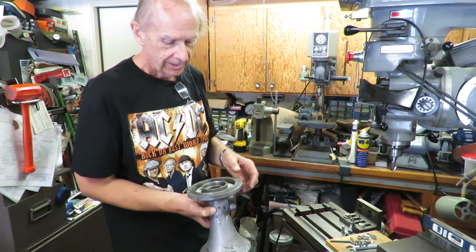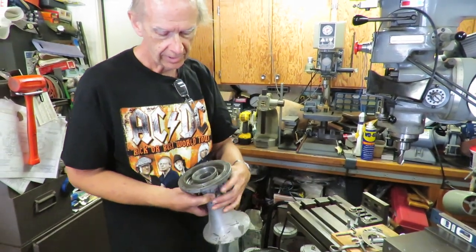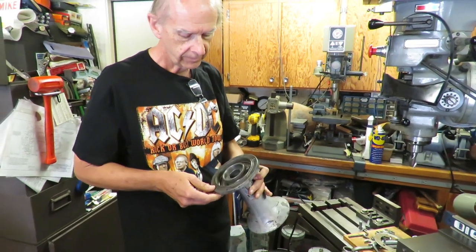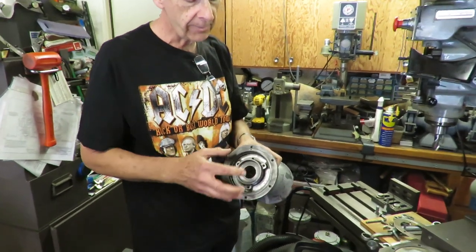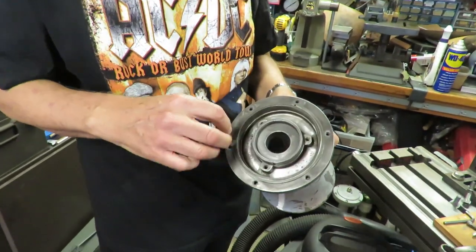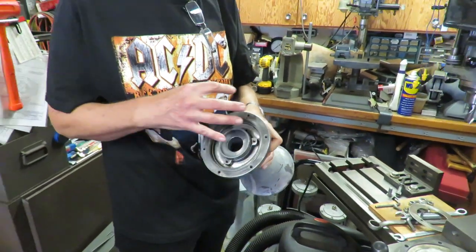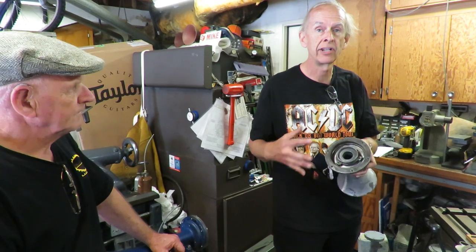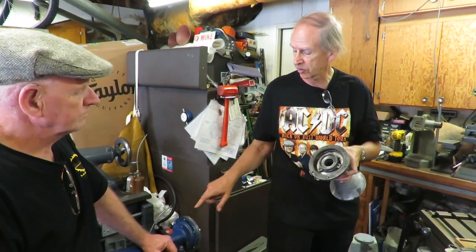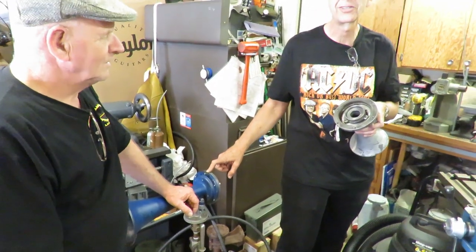When they arrive at your place they're not pristine and clean inside like that. You do a bit of heavy duty work to prise these pieces apart. This one's not too bad a shape — it hasn't been re-machined. But many times these surfaces are so worn out the bell becomes inoperable. Part of the restoration process is to re-cut all of these surfaces back to factory specifications so that the diaphragm is properly tensioned and the horn works properly. This one has been re-machined — the one I just demonstrated — and you can tell it was quite healthy from the sound.